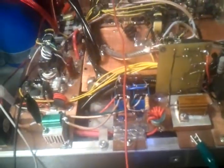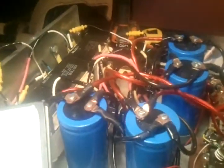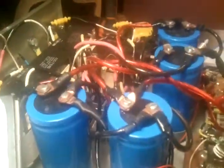By the way, as you see, this choke is carrying power to two 100 ohm resistors into the 12 volt relays. Those are current limiting resistors just to keep a good 12 volts going to them when this hefty power supply is on, because that's going to be pushing some voltage. You just think about when that thing's idling, 20 volts are hitting those relays. So what we're doing when we're flipping the switch up here at the remote head is just sending a ground to which relay we're wanting to turn on.